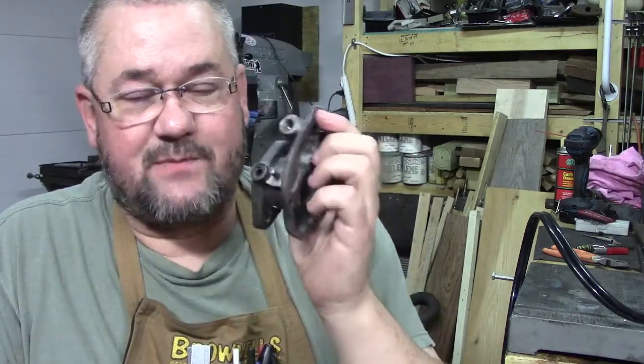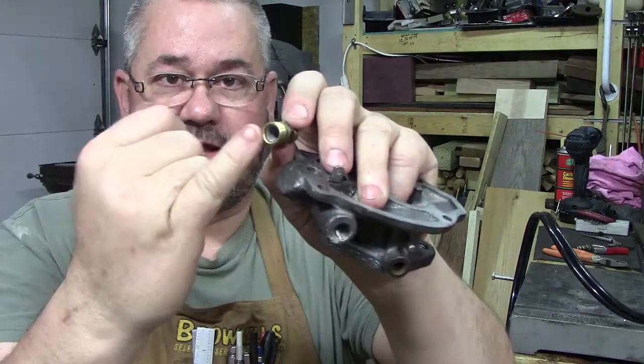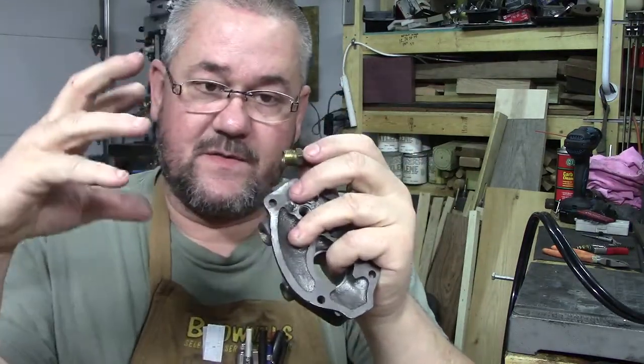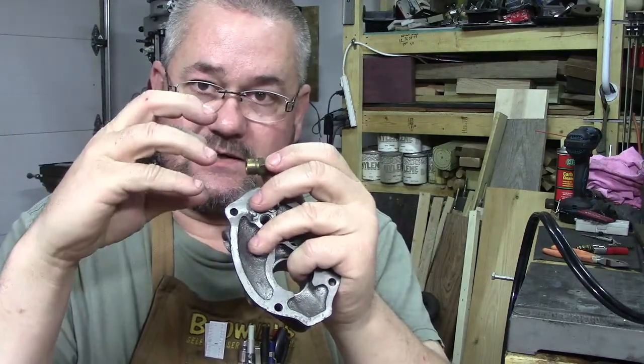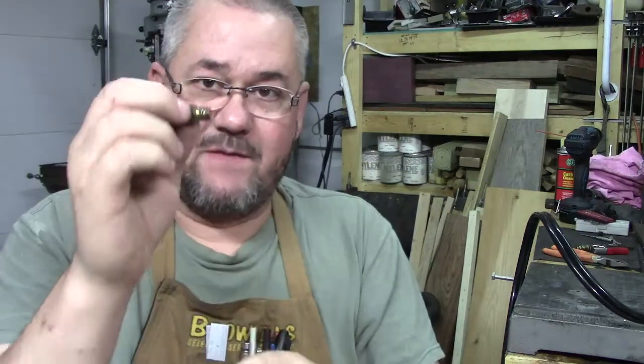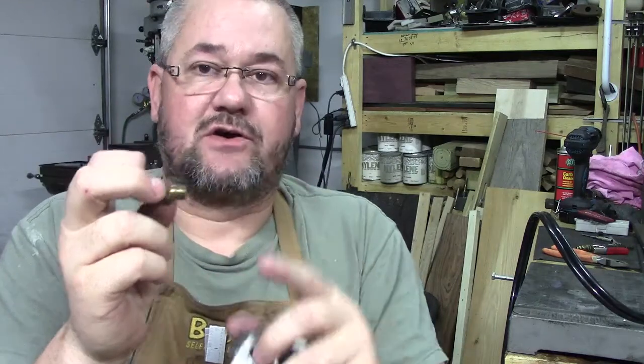An old machinist years ago did this initial type of repair and showed me, if you ever run across it, this is how to fix it, because we're going to braze it up in here, the whole nine yards. And this end actually has the ferruled end fitting, whether it's copper or steel pipe, it has a ferrule. You go in there and you tighten the nut down and it swells up. So what you actually do is you remake this whole thing, and we're going to do that in this video series, and you make this longer.